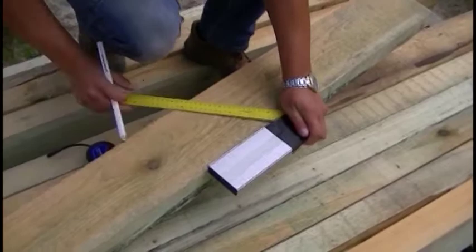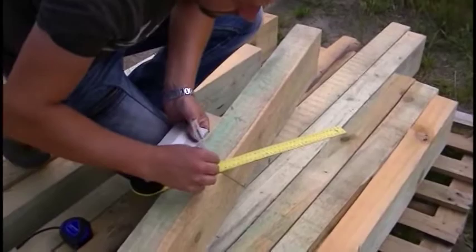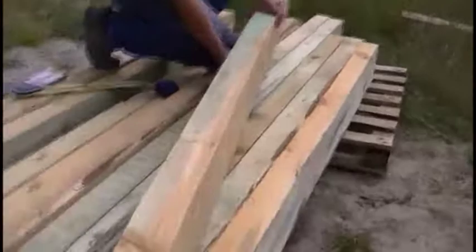At this peak, we are drawing two angles. One of them is the angle of the roof slope and the other is an angle of 45 degrees. This is the angle resulting from the position of the hip rafters, which are always the square diagonal. This, of course, we draw around the beam to make it easier to cut out, so there is no confusion. After reversing the rafter, draw the rest of the lock.